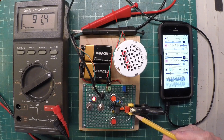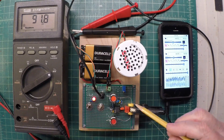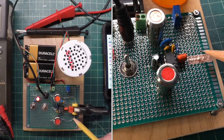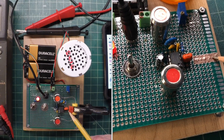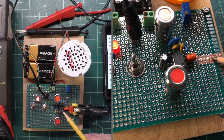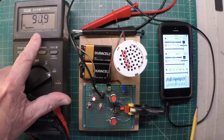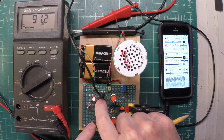Okay, you can see I've got the capacitor hooked up. I've got a little plastic clamp here — that's just to hold the capacitor down over the top of the copper strip. This is my pickup lead here that ties back to this capacitor, which ties back to the op-amp input. I can also place my finger there and hold that down. You can see the meter reading here — I'm in millivolts. We'll flip the switch now.